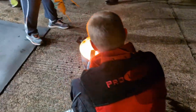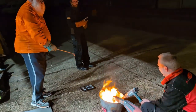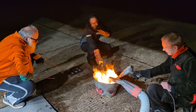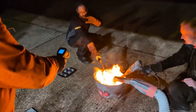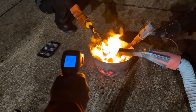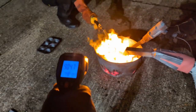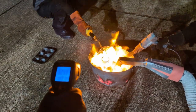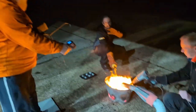So, again, with the copper, we want to be near — that feels near enough. To not be dangerous. I'm going to have a little look at the thermometer here and see what we're getting. We're at 900 — 800. You can see the numbers: 904. Don't know how accurate this thing is. But right at the tip there it's looking less than 800. And so, of course, we're going to be pouring down that bit, around the corner.